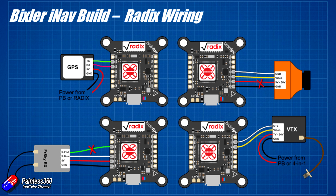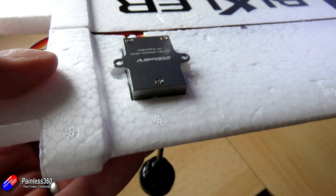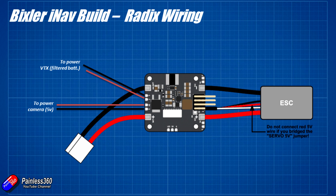The Brain FPV manuals are fantastic and explain how to put it all together. The wing power board — the WPB — has pretty straightforward settings and supplies the power needed for both the video transmitter (I'm using an elite video transmitter from Hobby King) which will fit beautifully, sunk into one wing of the Bixler. The GPS can go on the other side. It also provides clean 5V power. The 5V BEC is a 2A steady — I think 3A burst — and it'll run the receiver, camera, GPS and the Radix, so it should easily cope.